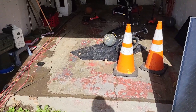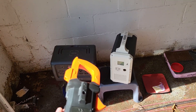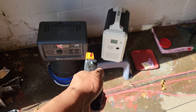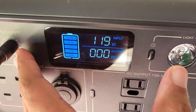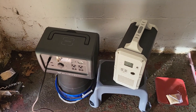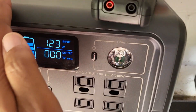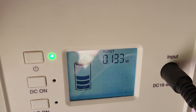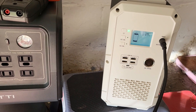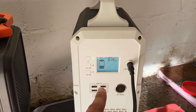All right, it's hooked up. What we're gonna do next is look at the output and also look at the amps, because this device has an 8 amp input limit and this one has a 10 amp limit, so we should see a difference here. Right now we're getting about 120 watts on the EB70. Let's also look at what kind of power the EB120 gets — we got 123 here, so 130-something. Measuring the amps is going to be important because I don't fully trust this screen.